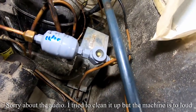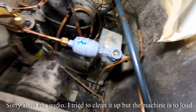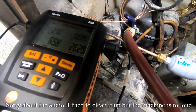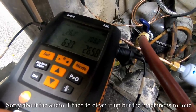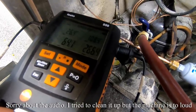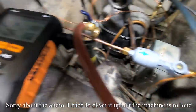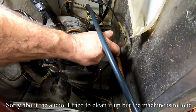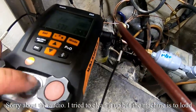It's going to take about eight more ounces. The head pressure is already a lot higher than what it was originally - it wasn't even 100 degrees, it was about 80, whatever that is pressure-wise. You can feel the warmth - we were low on charge. Once we get done here I'm going to scan it for leaks with the electronic detector and see what we got.